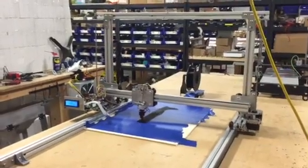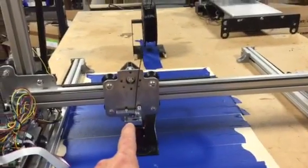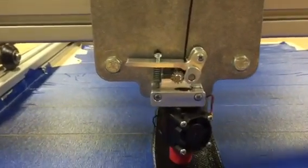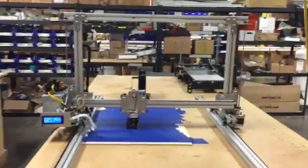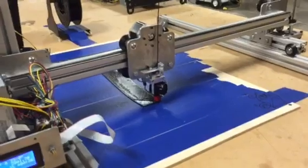I'm excited to get this up for sale to see if anybody else wants to experiment with printing big. By the way, Big E means big extruder — we want to replace this little guy. This is actually the gear head, like a dual pinion gear thing. We actually want to replace that eventually with a pellet extruder or very large versions of some yet-to-be-designed UBIS hotend.